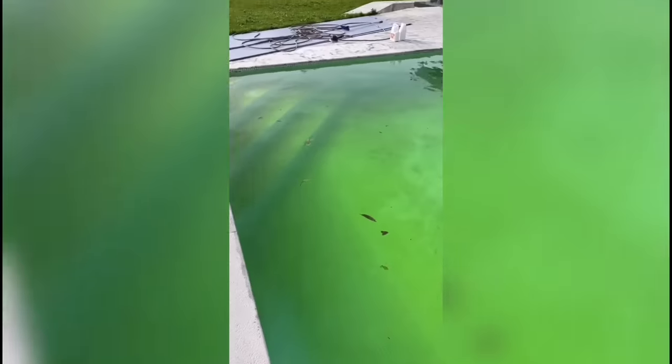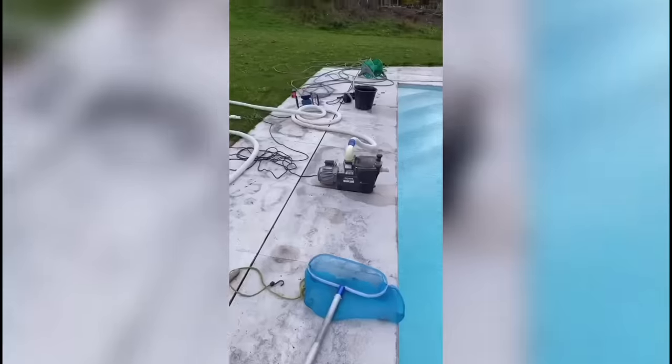Come to this pool - it's quite green, clear but a lot of algae stuck all over the surface. Get the brush out and brush the whole surface of the pool, disturbing all the algae off the tiles. Get the shock out, sprinkle it all around the pool and continue brushing. Come back in a couple of days - and here we are, nice and clear.